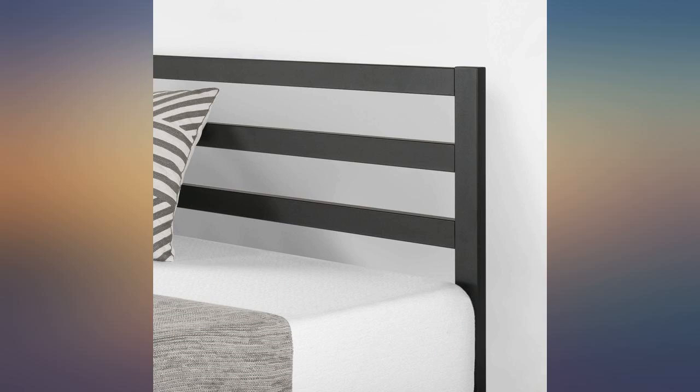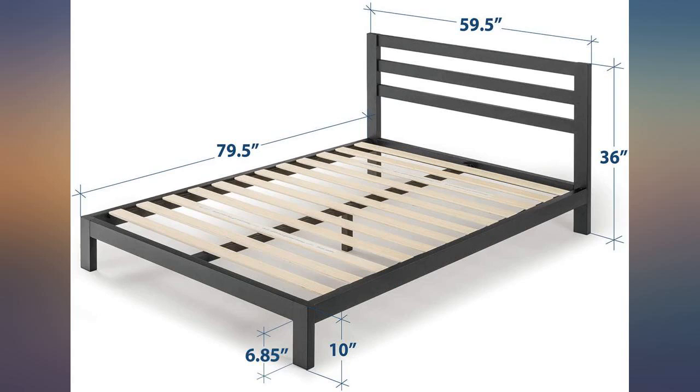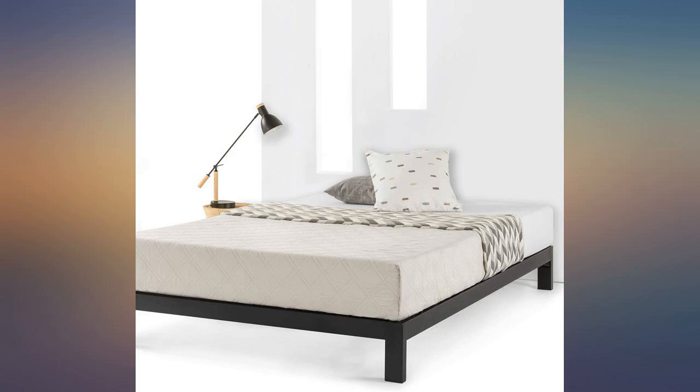Your best bet is to put a screw on one side halfway in, then go to the opposite end and do the other hole — front left and back right. Then screw fully and put in the other two. Also, you don't really need to remove the tape backing. The bed stays in place just fine, as it would just stick to the underbed surface.